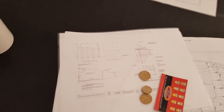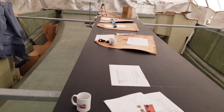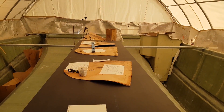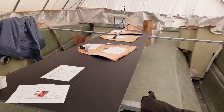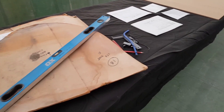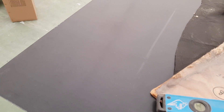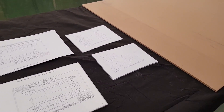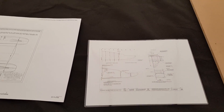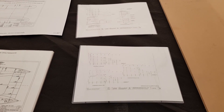I've got my wing plate template diagram and I've got to loft them onto some MDF to get a decent template for the forward wing plates that run vertically along here — they're compartments. Hoping to get those pretty much sorted today. I've protected my table with felt — an old kayak cover cut in half — to protect the form ply surface because I intend to lay up on it later. For now I'm starting the lofting to produce these wing plates that fit up into the bow and form the compartments for the front of the bow, including the chain lockers.